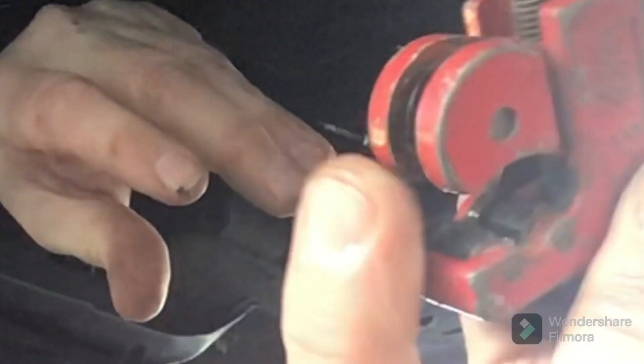I need something to cut it with. I'm gonna cut this pipe here. If you don't know how to use one of these — don't drop it on your face — they're really, really easy. This little pipe cutter, to be honest, is probably older than I am. You just put it around the pipe; it's got a little cutting wheel right here. You just tighten it up real tight and go around in circles, then tighter and in circles, then tighter and in circles, and then it pops off. And it even makes that sound. It's off — that easy. A little piece of pipe.